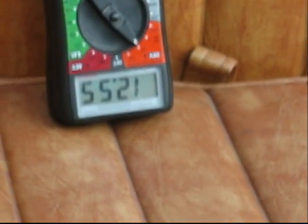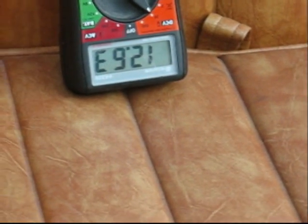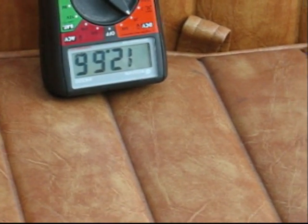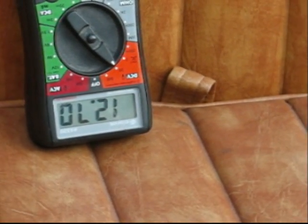We've got a reading of 12.5 now. If I start this thing up you'll see it'll raise. We'll test it out on the water, but that's a better sign than before, which was 12.2 volts. Any time I turn accessories on it seems to want to charge more. So what we'll do is turn a light on and throw the fish finder on and see what it does.